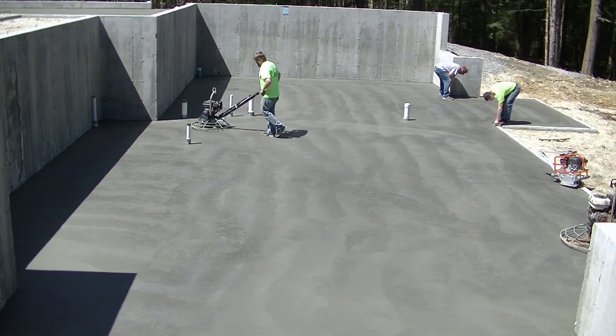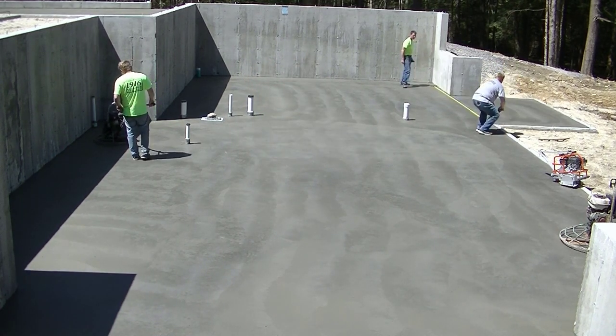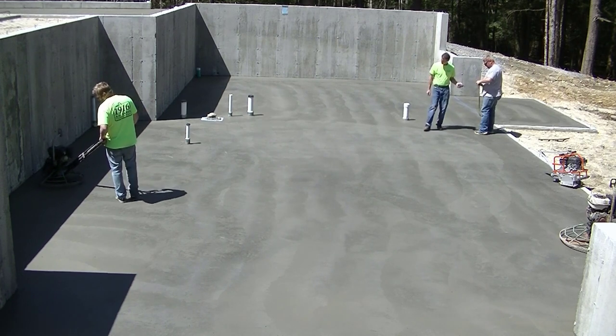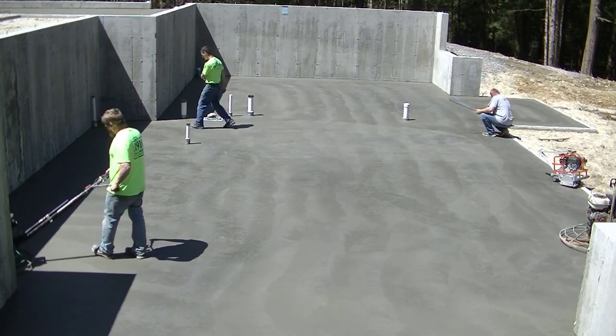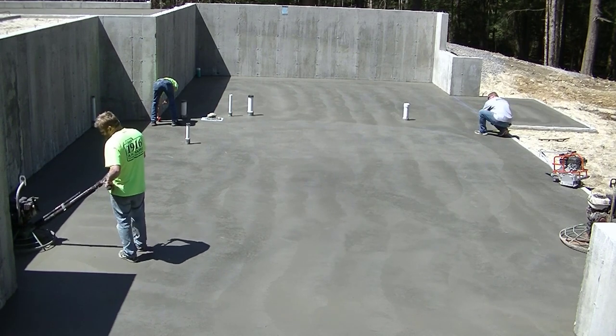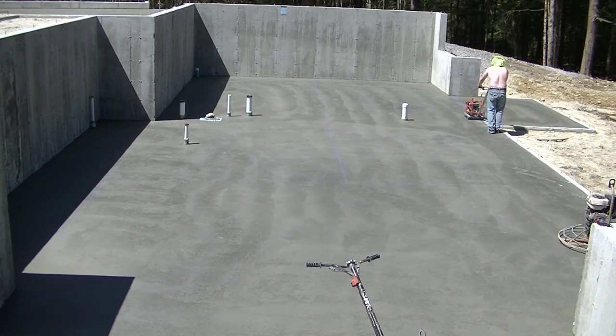This is the last pass — the floor is pretty rock hard now, it's just about done. Luke and I are snapping chalk lines where we're going to saw our expansion and contraction joints, taking measurements and figuring out where this floor is most likely to crack. That's a Husqvarna soft cut saw — a Prowler 150 — made especially for cutting green concrete like this, so we don't have to come back the next day. It takes a six-and-a-half inch blade, cuts down about an inch and a half, which is plenty deep enough in a four-inch floor to make the concrete crack right in the saw cut.